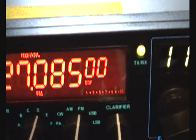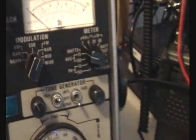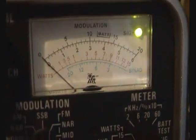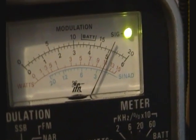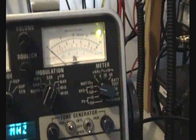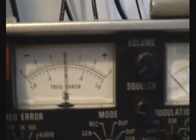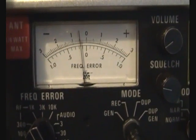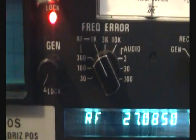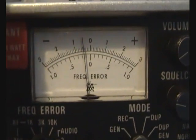I might try some power output while I'm at it. Let's put it on the watt meter scale - we're on the 15 watt scale. Check the mode is FM and I think it's set to flat chat. We're using the red scale and that's about 11 watts. Let's set the right frequency and see what sort of frequency error we've got. This test set's got a current cal so it should be pretty good. We're on a 1k scale, that was about 150Hz, which is pretty reasonable I think.